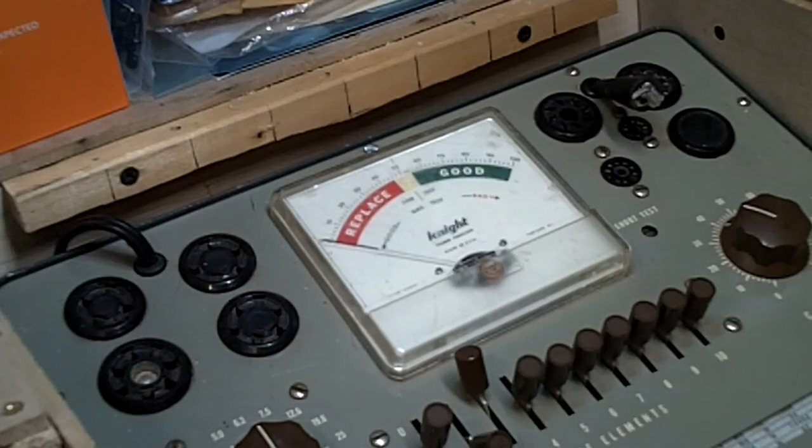And next up for this radio is probably an alignment. Now I do have one little task. I may film that as well. I have to set up a coupler for it. I don't remember if I told you this or not in the previous video segment, but the coupler is bad on the output tube there. It feeds the output, and the coupling capacitor inside that coupler is what's causing the positive voltage on the grid of the 6V6, and therefore we need to change that so there's no positive voltage. That will help run that tube and also other components in the radio. So we need to take care of that, and that's probably going to be next. And then after we get that all done, we'll align it, and we should be good to go then. So, all right.